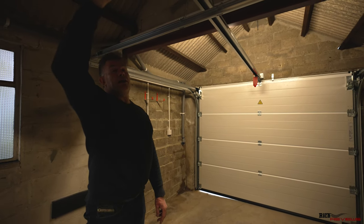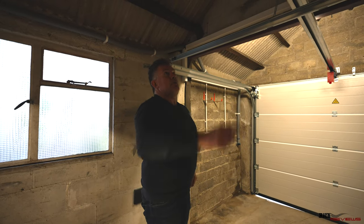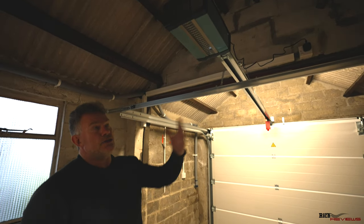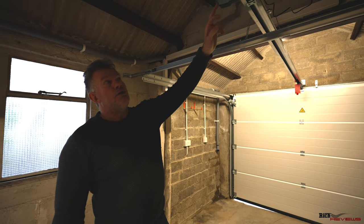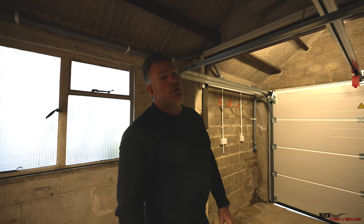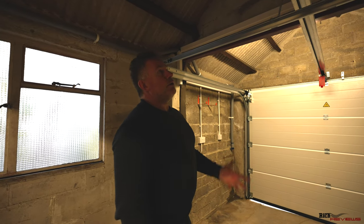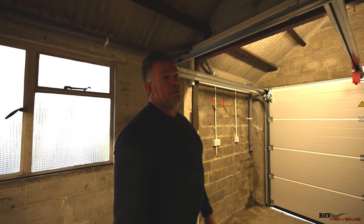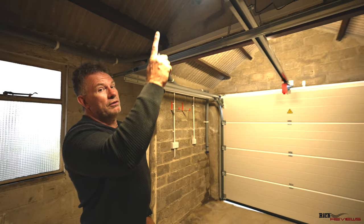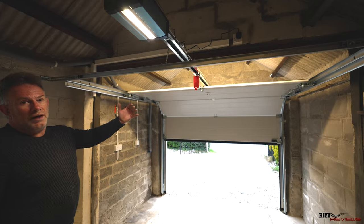And this Supermatic E4 motor is stronger as well. That's the screw that I left up there. So this Supermatic E4 has more torque and is faster at pulling the door as well. It didn't need to be a Supermatic E4, but I upgraded the motor because I wanted it to be faster, to have more torque, to be more durable, last longer. It enables you to open the door more times per day, per the unit. And just more robust and better engineered in effect. So press the top button, open up the door, light comes on. As you can see, it pulls the door a lot quicker than it normally would.